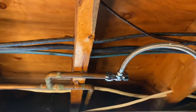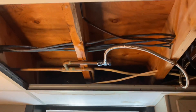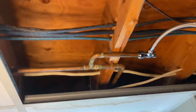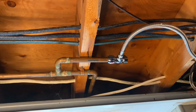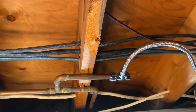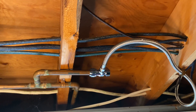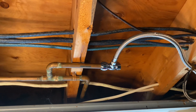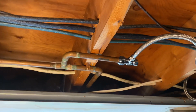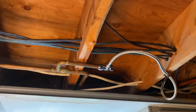I'm feeling pretty confident because we measured, we deburred, and everything is great. One important thing to mention: never use sandpaper or a scuff pad on the copper as part of your prep work. I was given that advice and guess what — it leaked when I did it. I deburred with a knife just like I did here but also used a scuff pad, and it leaked. Since then, I've just deburred with a knife, not scuffed it, and I've never had a problem. If anybody tells you to do that, don't do it — if anything, it lessens the seal. You smooth out the copper and it allows water to get past the seal. So let's move on to our next step.